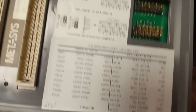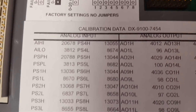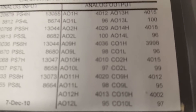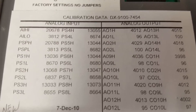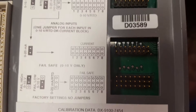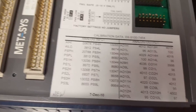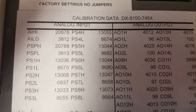If you turn over the DX9100 to the back side — this one has been removed from the base — you can see this white tag down toward the bottom underneath all of the jumpers. This tag gives you the values for the configuration that this particular DX was set up for from the factory. If these values are changed or modified in the programming, the outputs and inputs may not act as you expect. This project is a perfect example of that.